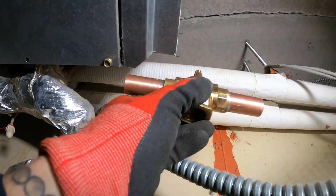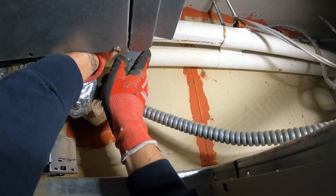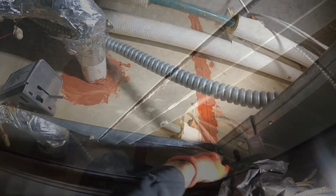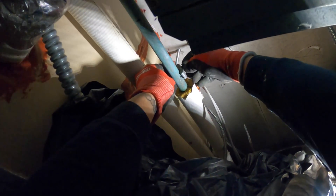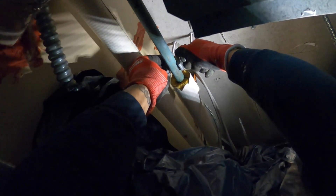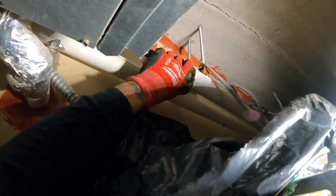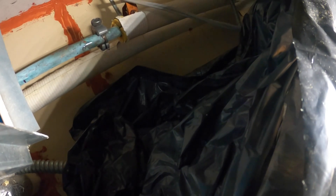Back in the ceiling. Thinking of putting this right here, so let me cut the insulation out. I set up a garbage bag and marked my pipe where I need to cut it. Valves are closed in the hallway — in the hallway we have two shut-off valves, we shut it down. Unfortunately we don't have anywhere to drain, so it's always a risk cutting these. There's a drip — looks like it leaked out but it looks like it's holding.